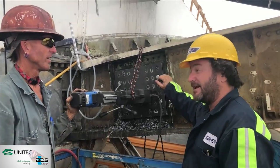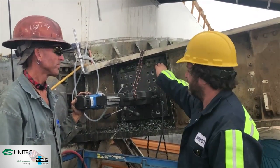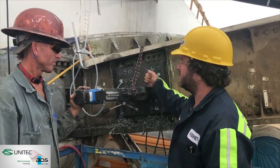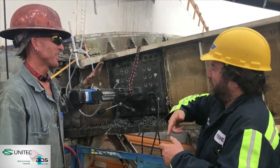Titanium is not ferrous, so it's not magnetic. That's why we've constructed this steel plate here — so the mag drill is hanging onto the steel plate. I've never used a mag drill before; I've just used a little handheld drill. This is an amazing tool.